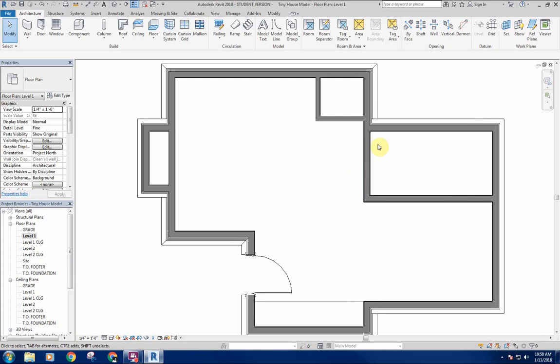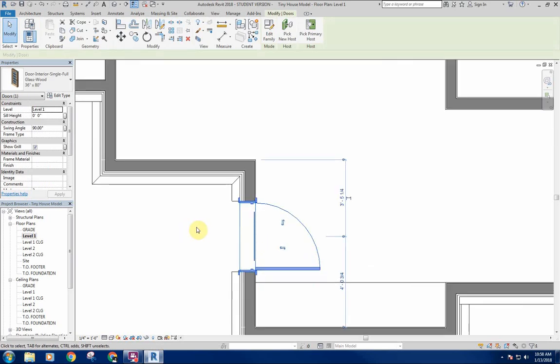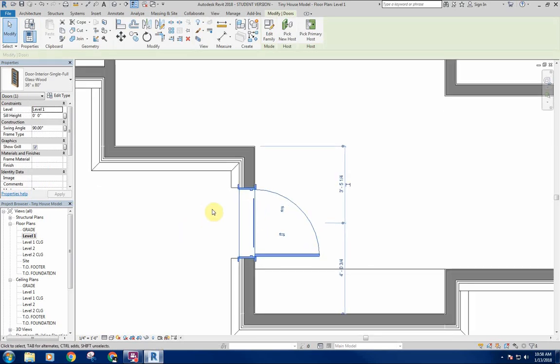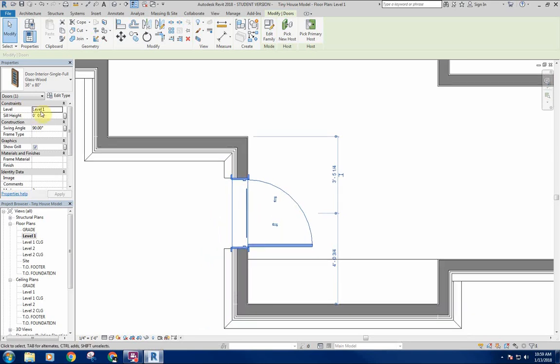Now for interior doors, I'll need a door into my bathroom and a door into my closet. Before we move on, one thing that I will need to look at is normally when you do an exterior door, you're not going to sit it right on the floor. You want that door to have a threshold, especially an exterior door when people throw down a mat or something like that. You're going to want to lift that door a little bit so that when it opens up, it doesn't bind the rug or whatever they put down there. So typically, in this case, we have a 2x6 wall. If the framer lays an extra 2x6 on the floor there just to raise the sill height of that door up an inch and a half, that's usually pretty good.